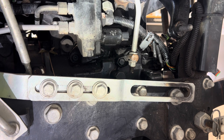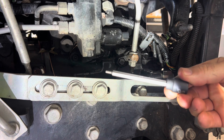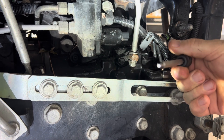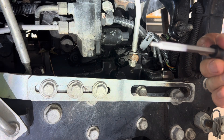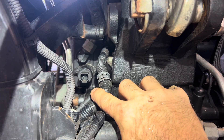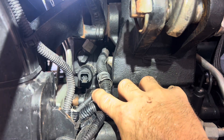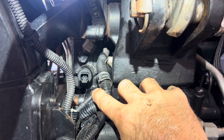For this next part, we're going to come around to the back. The two bolts that hold the PTO solenoid valve inside are hex, so I went and bought a kit of hex bits — they go into your socket. This is a 3mm which fits that perfectly. Looking from the back of the tractor in, you can see the PTO solenoid valve here and those two hex nuts that we're going to go ahead and undo.